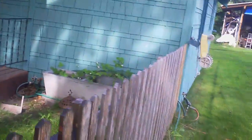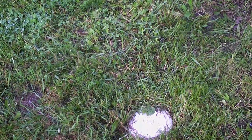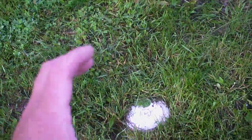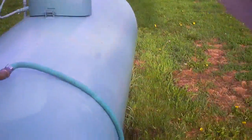I did have to pull the top off the well and blow it once. I guess that was 2 years ago. What it was is I had silted up. I had sucked silt through and had lost some of my sand points, about 24 inches of sand column, and I had lost about half, maybe a little more than half of that, because of the well silt. And yeah, I just blew her out with the air compressor, and we're pulling a lot more water through it than we were even back then, and so far no problems.